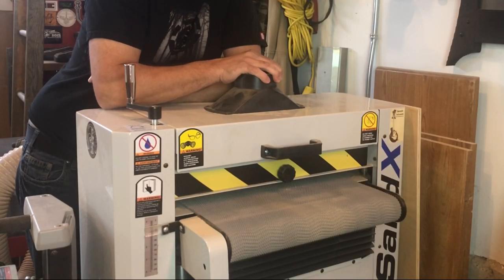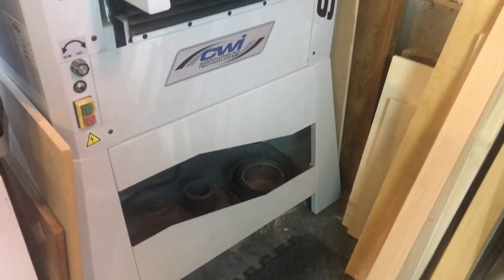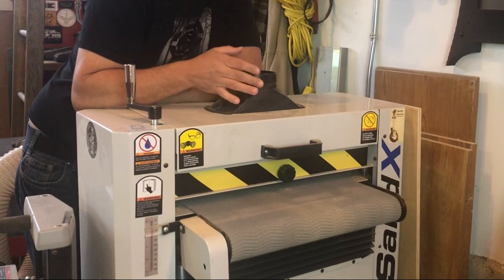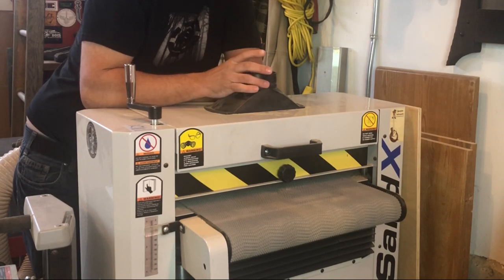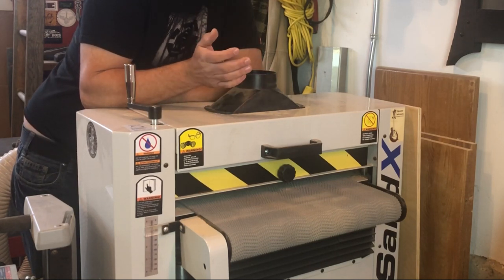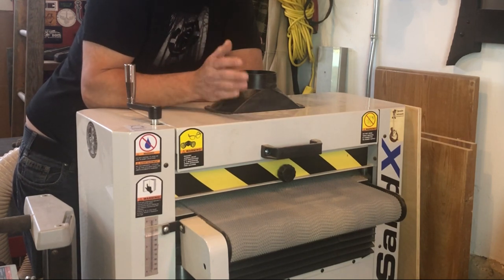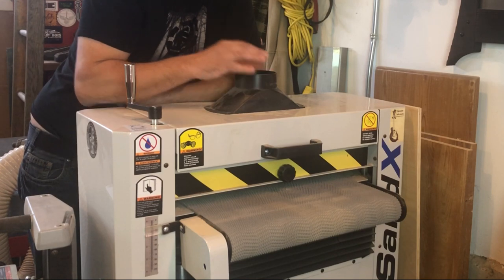This is the Sandex 17-inch drum sander from CWI — Canadian Woodworking International. I get a lot of questions about it, and after three or four years it's been flawless. The main issue is that it needs better dust extraction — a certain CFM that my dust extractor can't quite handle. To compensate I slow down the feed speed so more dust can exit, though sometimes it still piles up and binds on the roller. It also requires a dedicated 20-amp circuit or it will trip your breaker, but it runs on 120V — great tool.